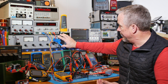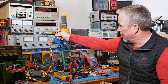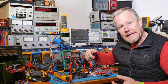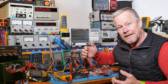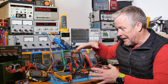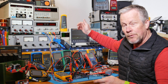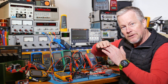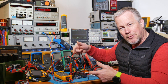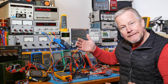We're going to look at the input power — I've got a Hantek current probe looking at one of the voltage rails, and then we'll look at the voltage down here on the board with the differential probe. Subscribe if you haven't done so and like the video if you like it. Check out part one where I talk about all this stuff, and there's going to be a part three where we're going to look at distortion. Part one we looked at the flatness of the gain — a Bode plot — and part two is going to be the thermal aspects and the voltage and current ripple coming into it.